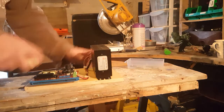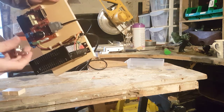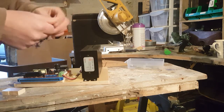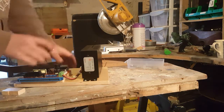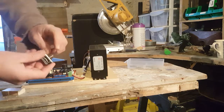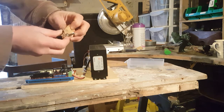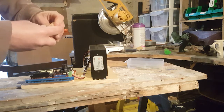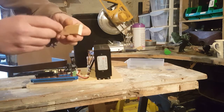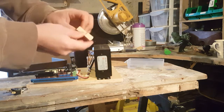The things I need to do here: I'm going to take the brown wire, which is live, and connect that to a switch - this switch here. This is a 220 volt rated switch, so it'll do for mains. I'm going to put it here, kind of stand like that. The way this connects - normally you drill a hole in a piece of wood, drive it through. This might be too big actually, but I'll try. I'm going to use this piece of wood, put it here, then drill a hole through that and pass this through. But I just need to first tidy it a bit.